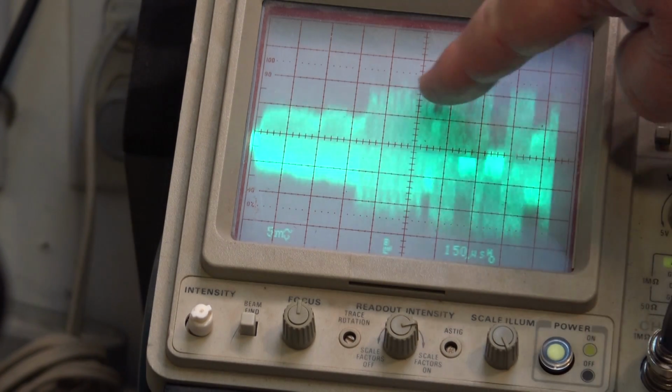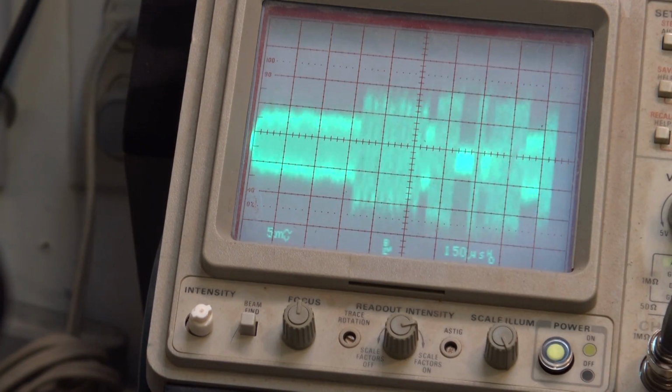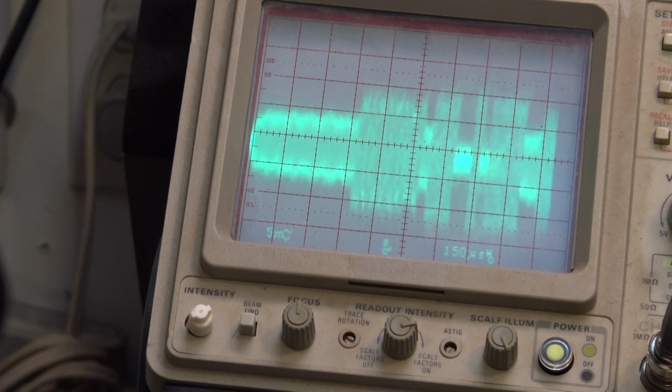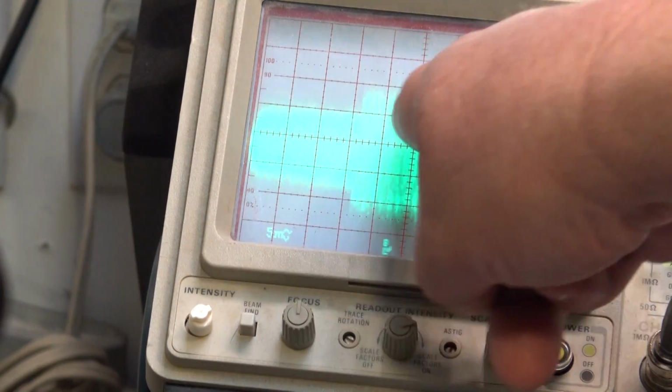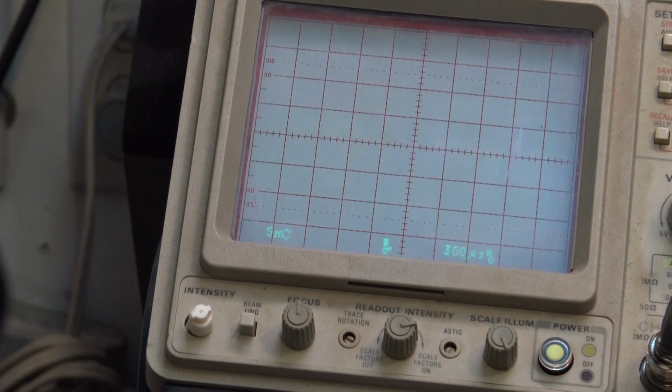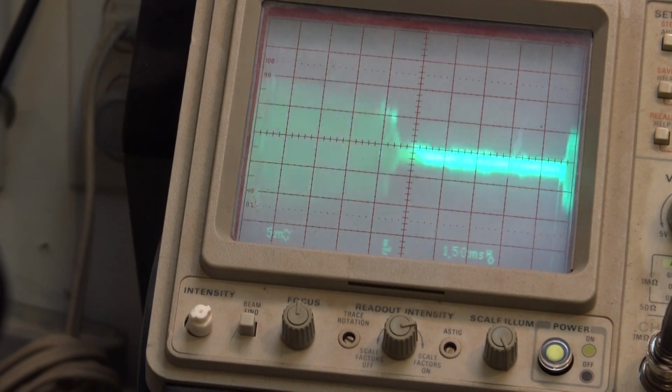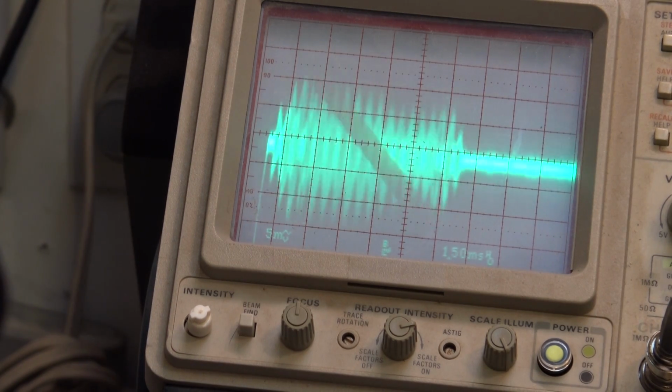They're stored in this payload portion at the beginning of each track, as well as your absolute time, which is your digital time code that is recorded on the tape. So this is actually recorded on the tape ahead of the audio payload. That's why you see a little bit of level differences on the payload. When we go back to look at it here, this is normally what we're looking at when we're setting up our tracking.